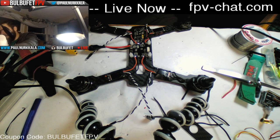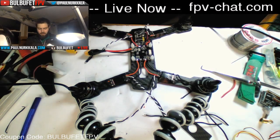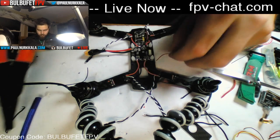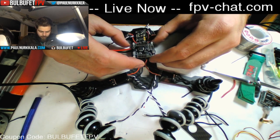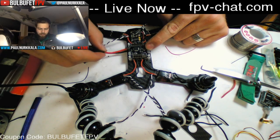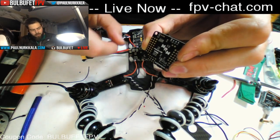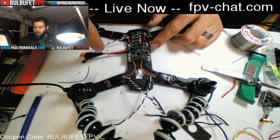I'm going to use some nice small wire for it because they're pretty small pads that are kind of a pain to work with. So here's some nice tiny wire. I'll just give it that much. Don't need a lot. And then I'm going to mount the board this way. Let's see. Is that right? That's the way I want to do it, so that I can get the USB port without being in the way of this thing. Because if you look at the bottom, the way that Multirotor Mania is pointing is forward, we're going to have to change in the flight controller software, the firmware, to point it sideways.